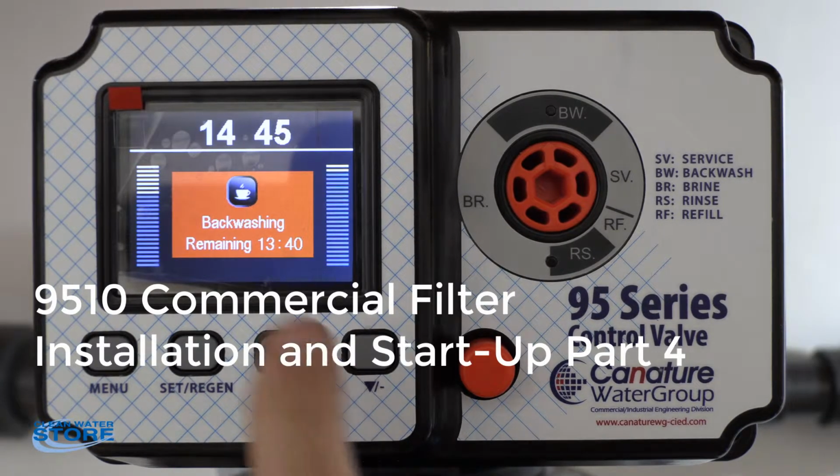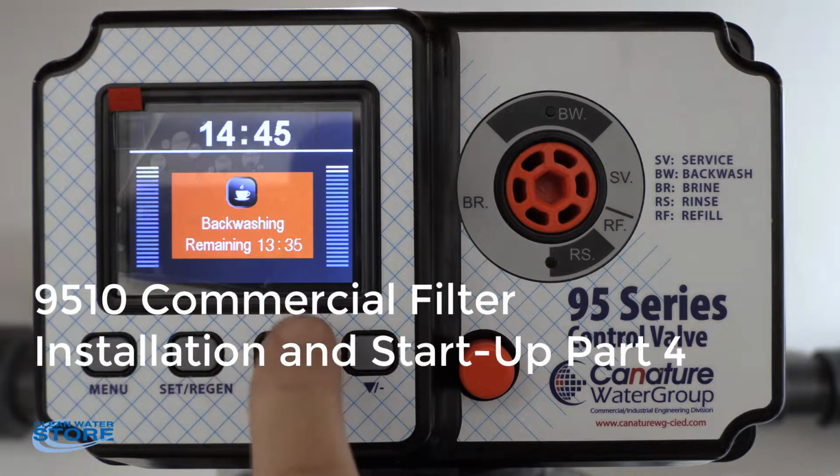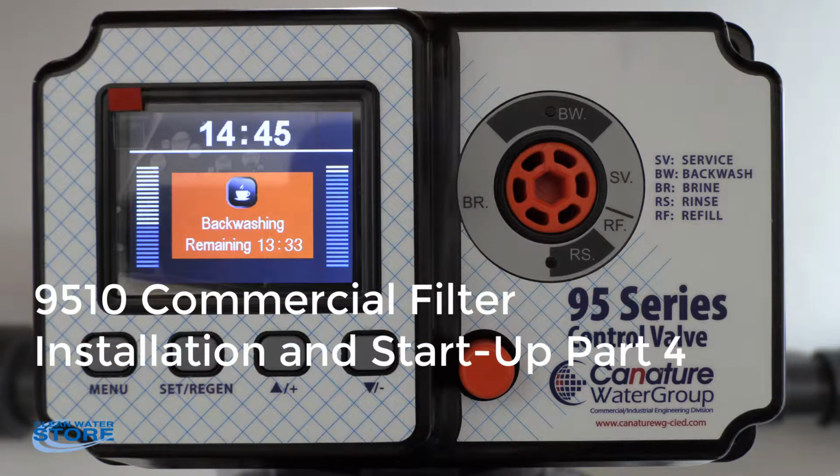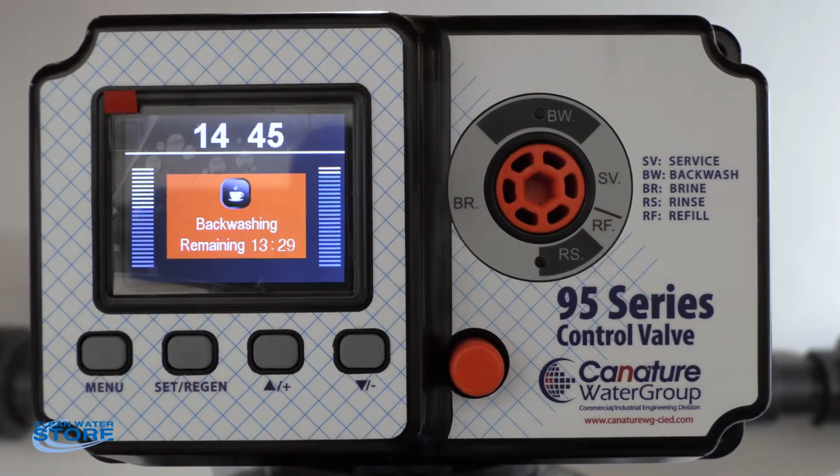Again, you can see that it's in the backwashing mode. You see the active bar showing you, and it shows you the time remaining counting down. So we're just going to go ahead and let that run. You're going to probably need to do this backwash rinsing 2, 3, 4 times.